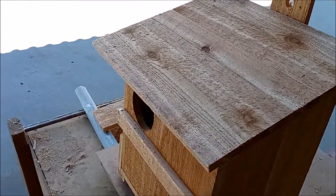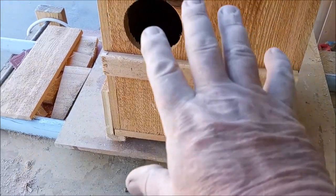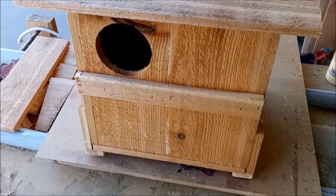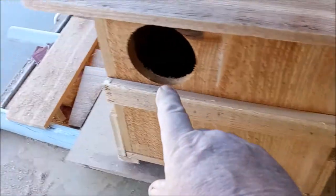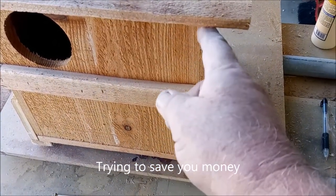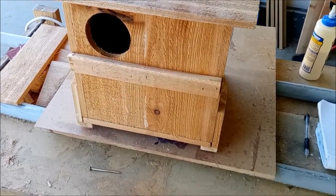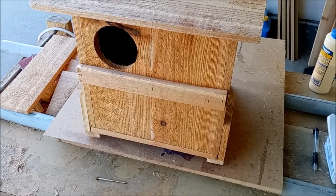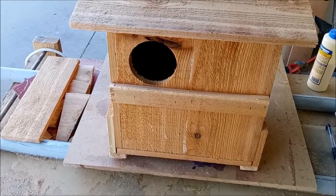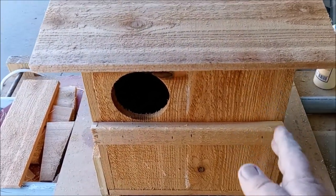The footprint on the box is about a foot square, so these are large nesting boxes. One change we've made this year is we used to bevel these corners. Now we're just doing a lap joint, and the reason for that is materials were going up in price and I didn't want to raise the prices on my boxes. We took away the bevel corners, which was actually taking away material to begin with.